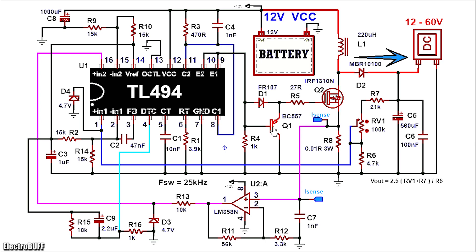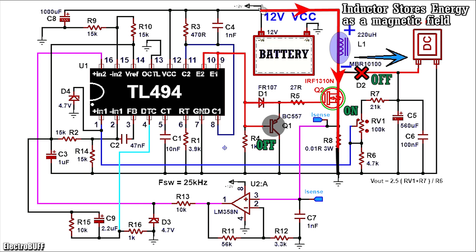The way the circuit works is very simple. Once the IC has begun switching, you'll obtain output pulses at pins 9 and 10 and to the gate of the MOSFET as shown. On the first case, you have a high pulse passing through D1 and R5 to MOSFET Q2. This will cause the MOSFET to conduct, creating a current path from the positive of the battery through the series inductor L1, through MOSFET Q2, through the current sense resistor R8, and to the negative rail or ground. Once this happens, energy will begin building up in inductor L1 in the form of a magnetic field. The polarities across inductor L1 are as shown.